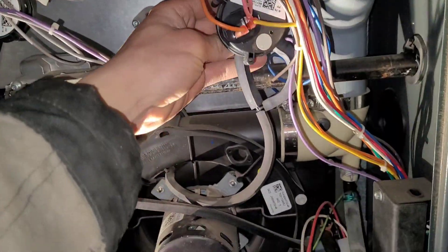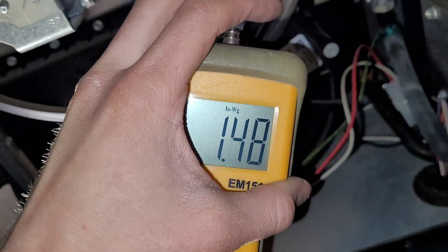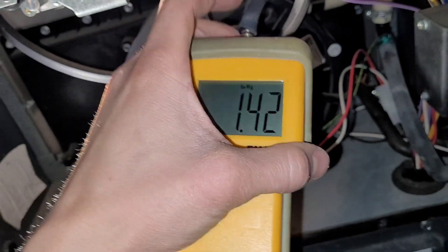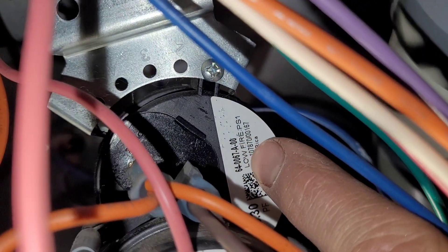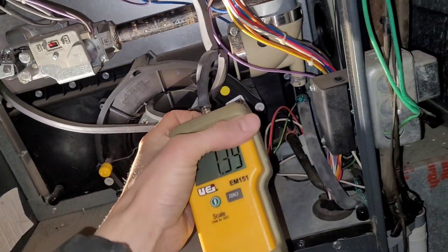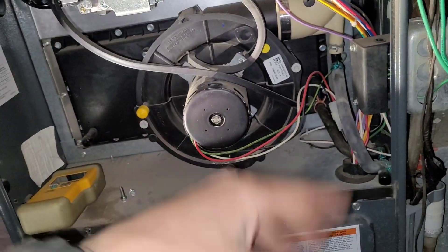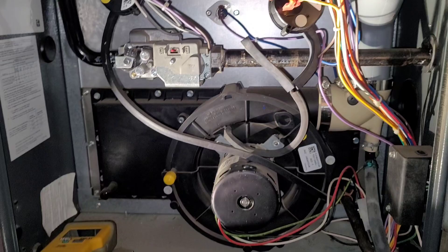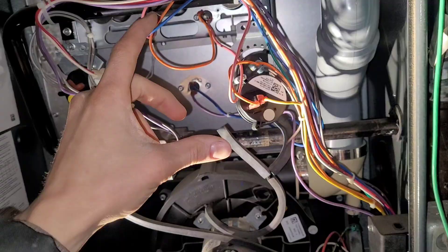You can see it's going to go ahead and light right now — I'm guessing it's running in the low stage. We're still drawing 1.42. This one here says low fire, and this one here is high fire. So that's why there's a pair of pressure switches — they verify airflow at lower speed and at higher speed on the combustion blower. We were having issues with the low fire switch being open when it was supposed to close, so we're going to change that out.